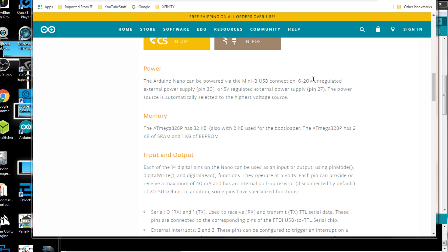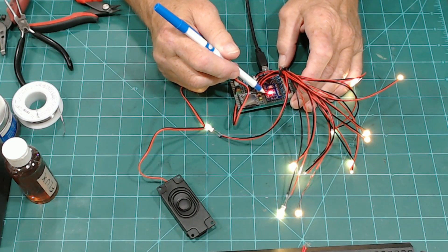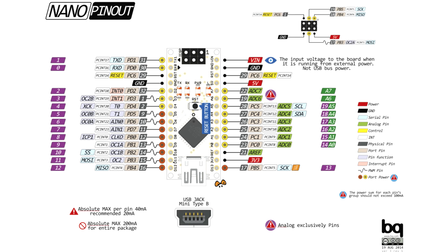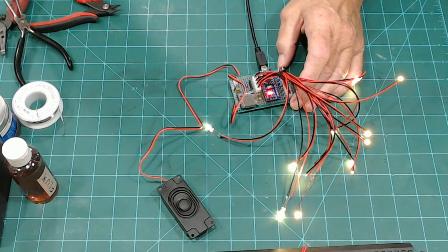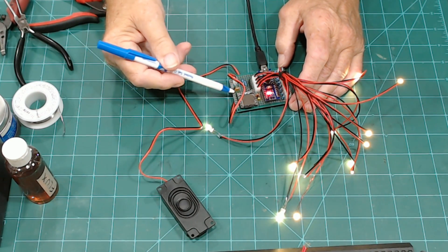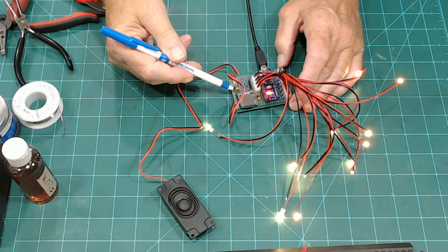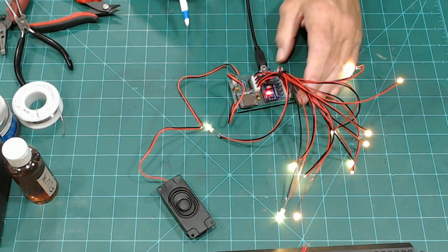You can see on here I have a plug for the power - I may change that to something I can just plug in and out. What I have this connected to is the VIN pin. You could use the mini USB for power, or you could put 6 to 20 volts on that VIN pin using an unregulated external power supply, or 5 volts regulated external power on pin 27, which is the one marked 5 volts. So if you had an old power pack from your DC days with the speed control all the way up - most of them were about 18 volts on the old ones - you could use that for this.